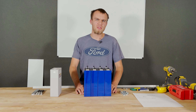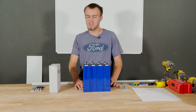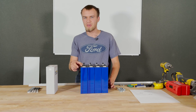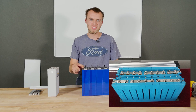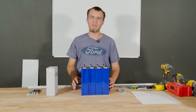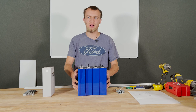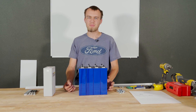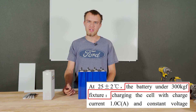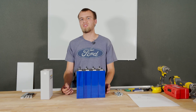This applies to about 90% of these aluminum case cells. Some aluminum case cells use thicker case material that is structurally integral — the Fortune cells, for example, don't need compression. But for run-of-the-mill commodity grade lithium iron phosphate batteries in aluminum shells, compression is required. Look in the specification sheets for the battery to see if they mention compression or fixturing, because if it's required and you don't do it, you could irreversibly damage your battery.